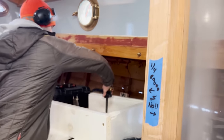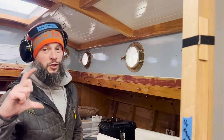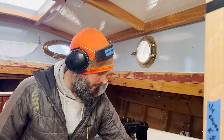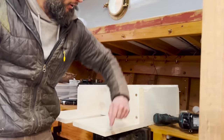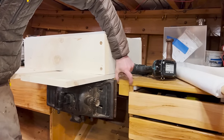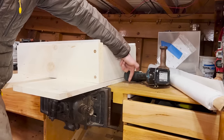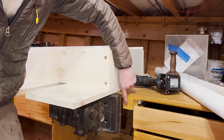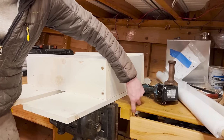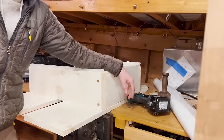Refreshing some dog holes. Yeah, so traditionally you would make like a 2-inch thick or more top, but I didn't want to put all that weight in the boat. So we've got pieces of thicker maple that go across the bench that the dog holes are drilled into. But this swells this way, and the top swells and shrinks this way. So I'm ever so slowly elongating the holes in this timber as this swells and shrinks. And the tabletop is thick enough, and this is thick enough, that even with that discrepancy, the dogs grab fine and it's all good.